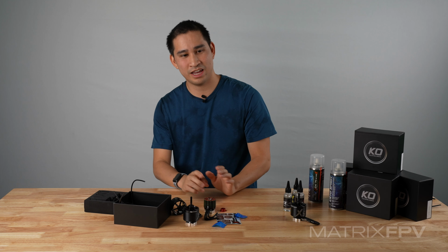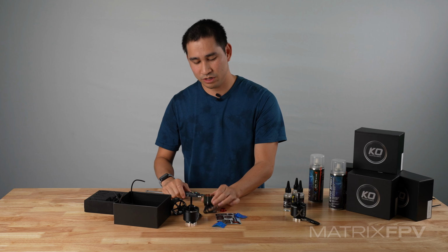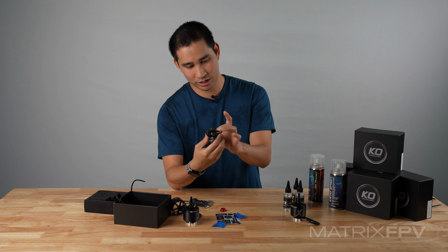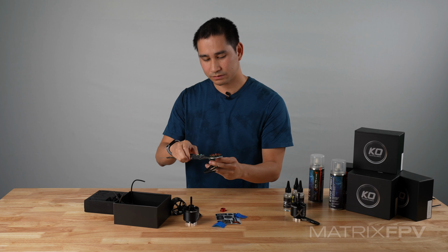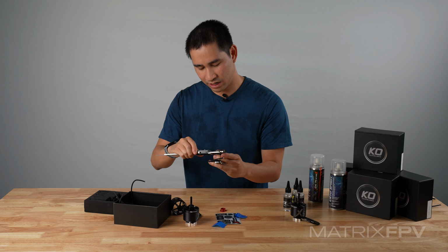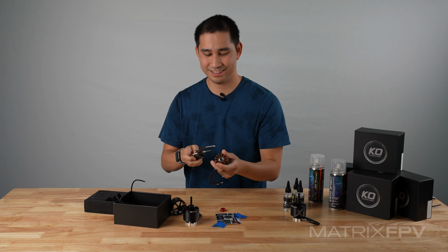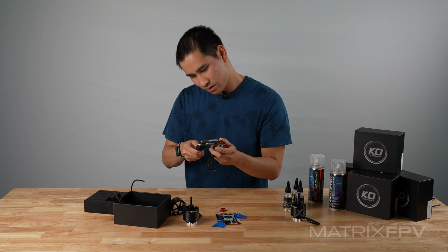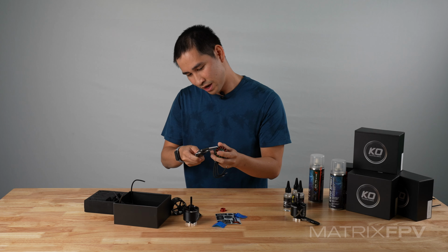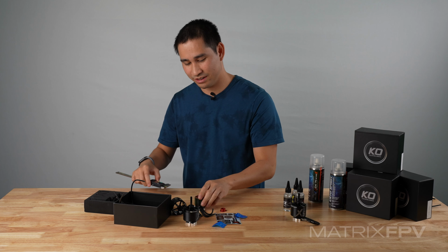So you're wondering, is this really a 40-25 size motor? I have some digital calipers. The 40-25 means that the first two digits say the stator diameter is 40 millimeters and the height is 25 millimeters. So let's turn these on and measure right here. It is 40.75 millimeters, so a little bit bigger than what they advertise. Excellent. And of course, the height of the stator: this is 25.81 or 25.79 millimeters in height, so also a little bit bigger. Excellent. So yes, they're advertising this correctly.